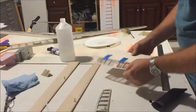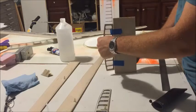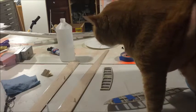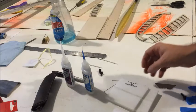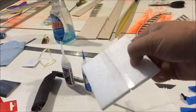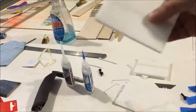Now we have nice movement. There's a very slight gap in there — they're actually not touching in the neutral position, just a little bit of a gap. I want to show you the different types of hinge styles that exist. The most simple style is just a single layer of tape. What this style does — it wants to come apart. Not exactly the best one.